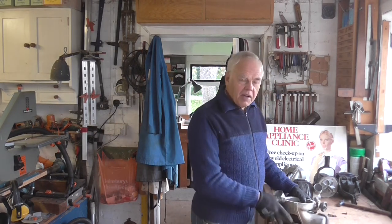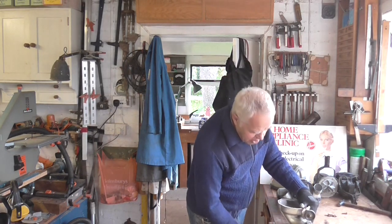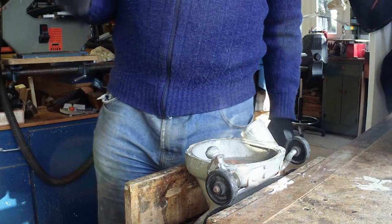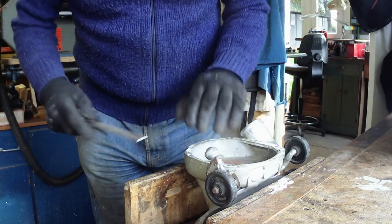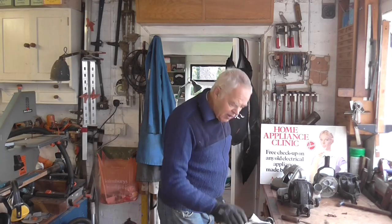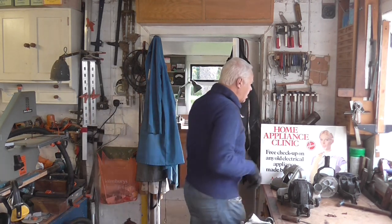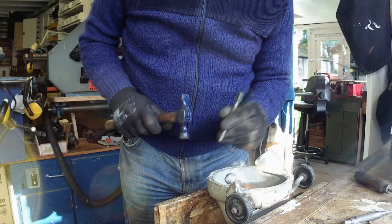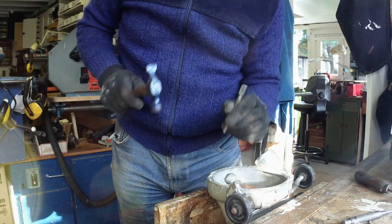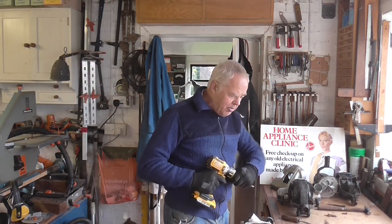In this case there's very little showing, so I'll pop the mole grips on and lock them tightly. It's not going to come out, so it's going to be Plan B. The only way to address this problem now is to drill it. First, get a small file and file the bolt down so you've got a nice flat surface to work with. Then don't try drilling it without centre-punching it first — put a little mark in it so the drill doesn't go all over the place. Use a small drill and gradually work upwards.